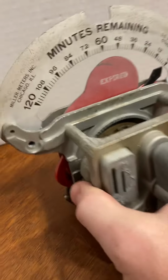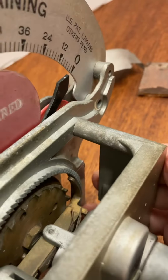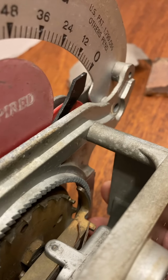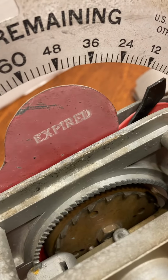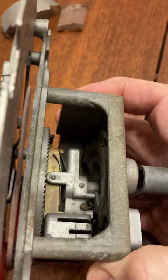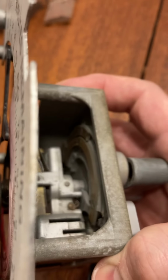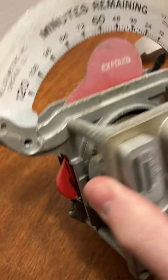On the inside, this does have a few different things. So look at the end of that coin transport mechanism. It's got that weird hook. I have no idea why that's even there. It's the first one I've seen like that. We have a brass winding wheel instead of an aluminum one. The coin transport mechanism otherwise is basically the same as any that you may have seen before, and all of the coin rings are in there correctly as you'd expect.